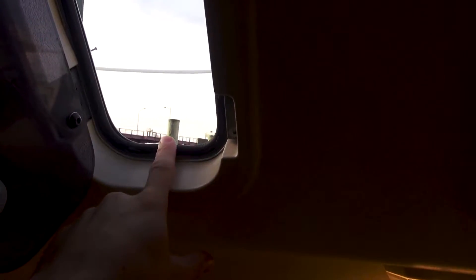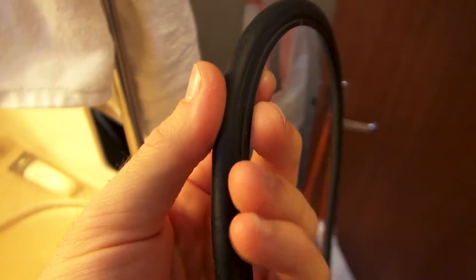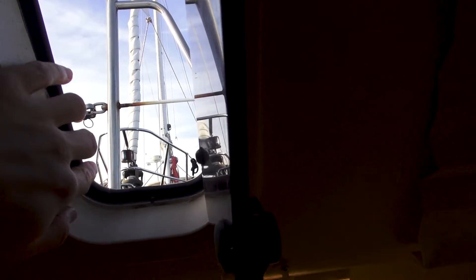This is the one I installed a couple weeks ago with my dad, and this one I tried to install on my own but didn't prep the frame enough — I didn't clean out the ridge that the seal locks into. If you look at one of these seals, there's a ridge with teeth on it that locks into a slot in the aluminum frame. I also found out you can stretch these seals like an exercise band to make them longer if there isn't enough coverage. This one went in fine, but this one I did have to stretch — it wasn't large enough right out of the bag, and I'd get one corner in and another would pop out.